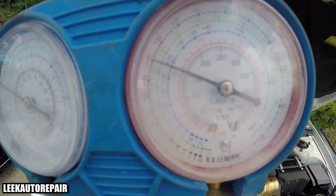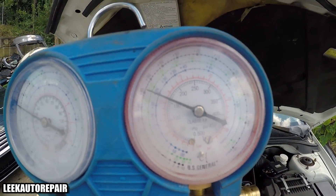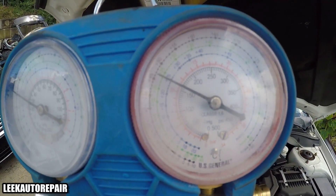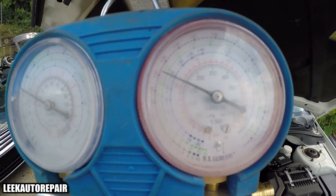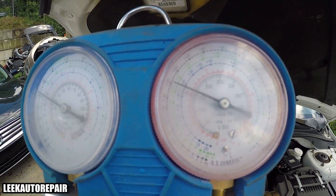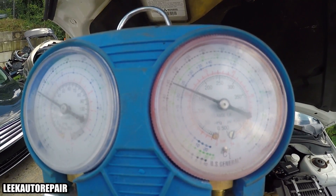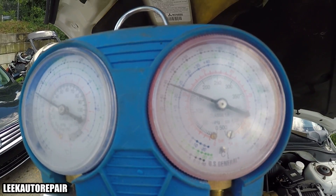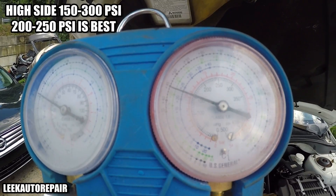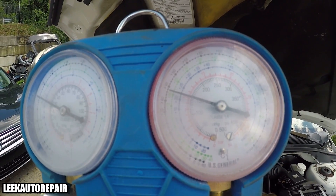You're always going to see some type of fluctuation on the high side — very rare on the low side. This is a used compressor but whatever. Right now this is a little bit above 150. This is a small compressor — you could go by weight but this didn't have a label so I went by my own readings. For the high side, I go by between 150 and 300.